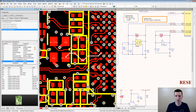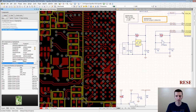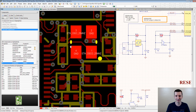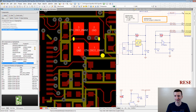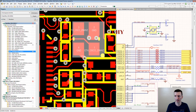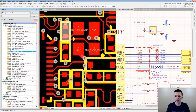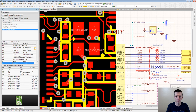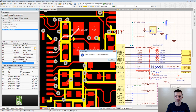It's very short. I can give you different examples — you can see we do it also on the other crystals, not only this one. This is a different crystal. There are two capacitors, again you can see very close to each other. And if I measure the distance, it's like 4.8 mm — even a little bit closer.